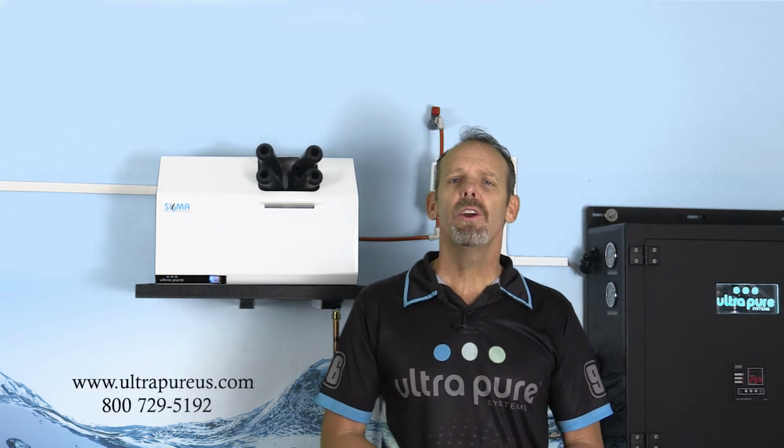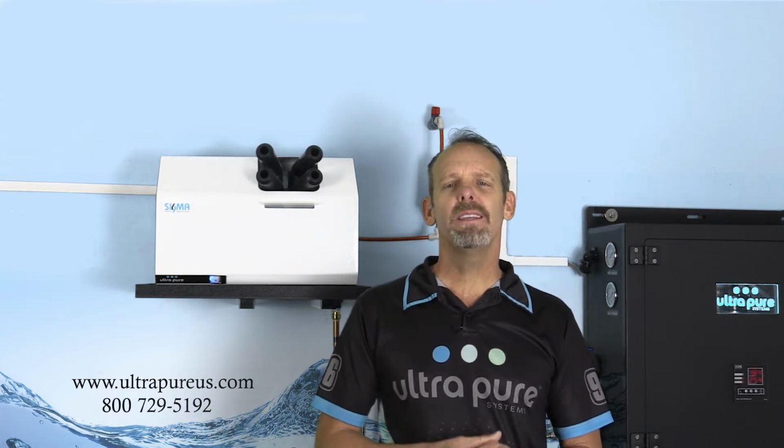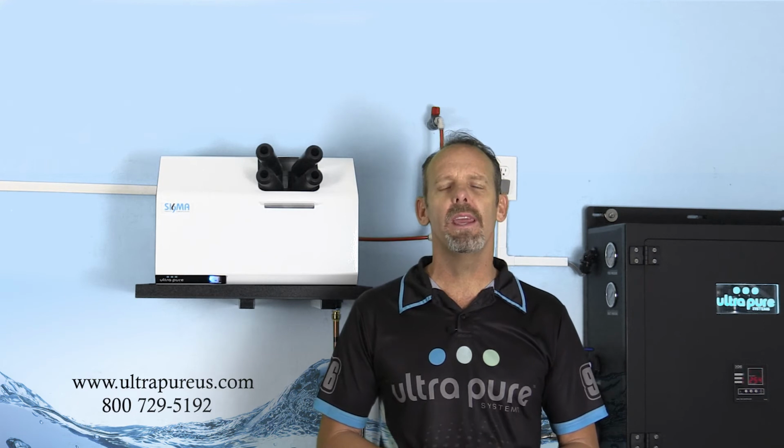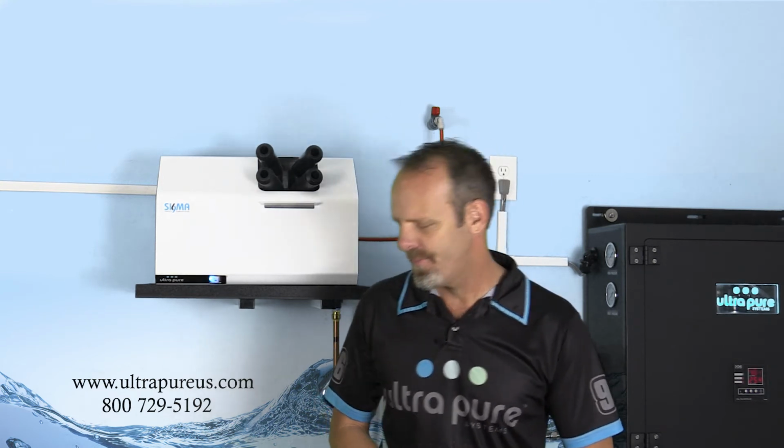From there, you're going to want to take that relative humidity set point that you would like to have and the temperature set point and convert it to dew point, and then we'll put it as a set point in the ultrasonic humidifier. But first, we need to tell the ultrasonic humidifier that we're going to control off a dew point, and I'll show you how to do that.